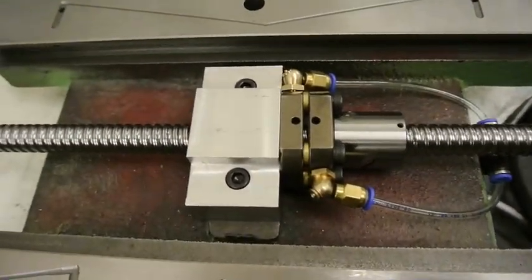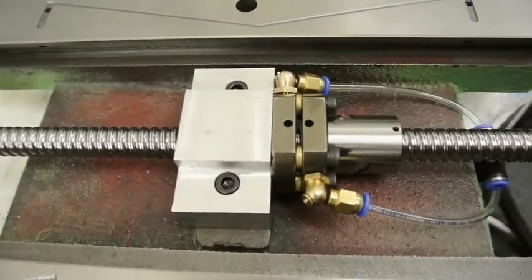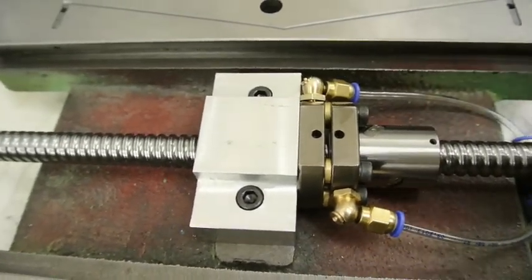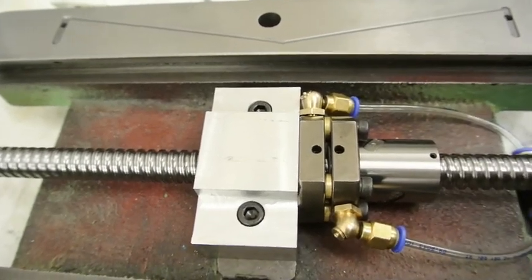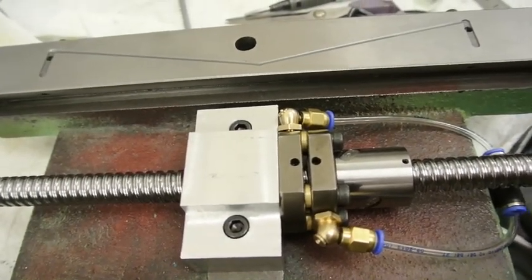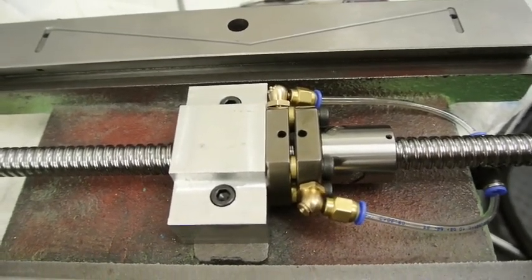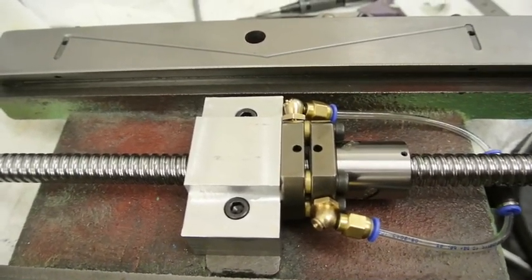I've made up a ball screw with oilers which fit in here. The ball screw itself is 16 millimeter diameter and there are two ball nuts which are spaced out. I made up two millimeter brass spacers as well as some shims. The advantage of making your own brass spacers is that you can lap them down, perhaps half a millimeter at a time, so they are even more accurate. I locked all the screws in with thread lock Loctite, which can be unscrewed if necessary.